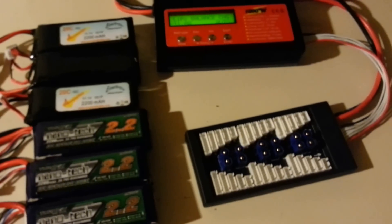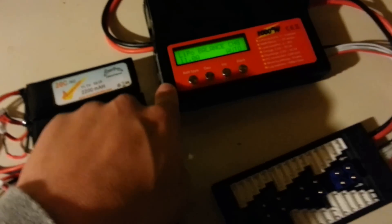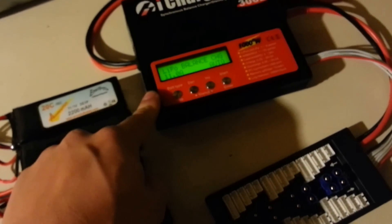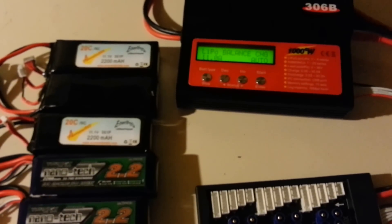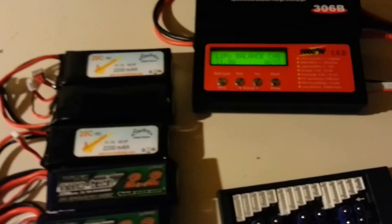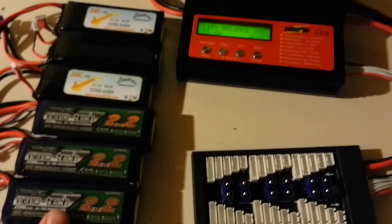You can use up to 38 volts on this board — the next logical step up is 24 volts — but I'm just using 12 volts right now and it goes so fast it charges all six in about 20 minutes. I'm usually busy flying and don't need 24. I might eventually get bigger batteries that need it, but for now 12 volts works fine.